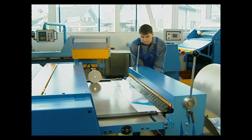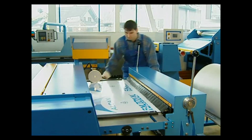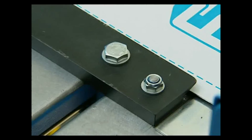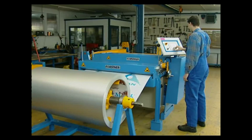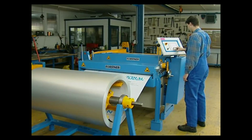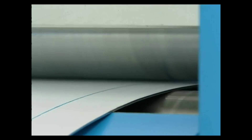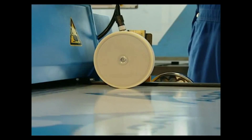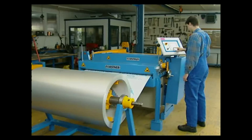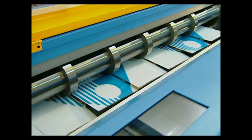Variable coil sizes, from as small as 4 inches to as wide as 48 inches, are loaded into the feed rollers. The edge is easily secured using the convenient hand wheel. Once engaged, the power feed cylinder takes over, ensuring smooth feeding of all your coil stock without scratching. Feeding speeds are infinitely variable, up to 80 feet per minute, and with Forstner powered decoilers, up to 125 feet per minute — meaning increased shop floor productivity.